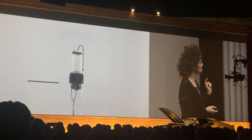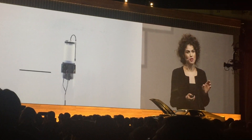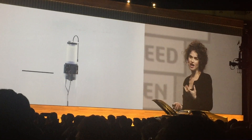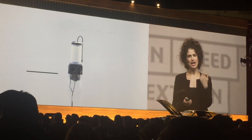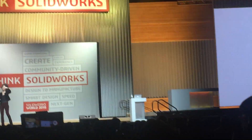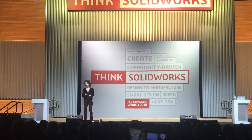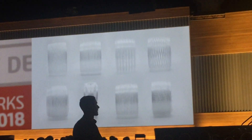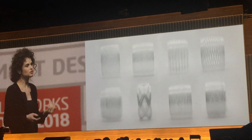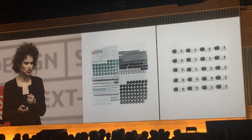We've developed most recently — and this is a project still under development — fiber bots. These are robots designed with a vertically winding system programmed to wind fiber as they climb on top of their own fabrication output. We can design geometries with different types of fibers; combinations of fibers and matrix. The robot is programmed to vary the distribution of those fibers as a function of the structural load.